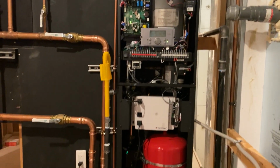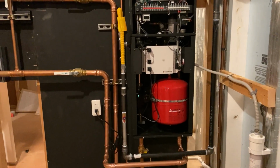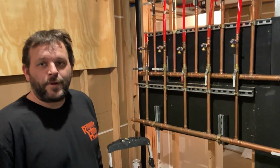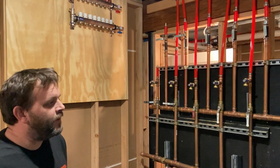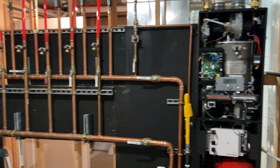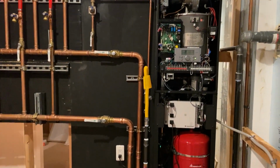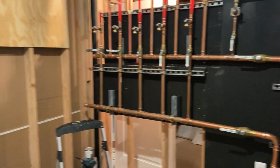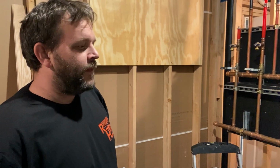Yeah, we put a couple pieces of wood up. I shot a little bit of blocking up, 4 screws, a couple of lags. Throw it on the clips, the boiler was up in an hour, right? Very simple, very easy. The piping, we can build the manifold, where all the T's and the takeoffs are, in about 6 hours. Shoot it up, and then it took me about 4 hours to pipe the boiler back to the manifolds. And another 4 hours to do all the incidentals like the relief valve, the flues, the vents, gas, electric, things like that. A solid, good day for a couple of guys down here, and you're getting this boiler up and going.